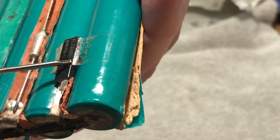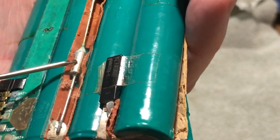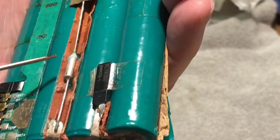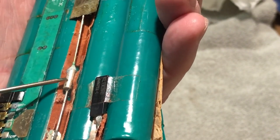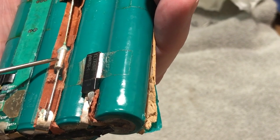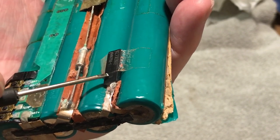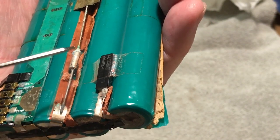When the battery is overcharged or gets too hot, that thermo cutoff is going to trip until it cools down. The diode basically keeps the cells from draining each other — if one cell is really low, it won't drain the other cells down. This protects the circuit; they put different diodes in for different things. I've checked it — it's fine, there's some writing on it. When I take this thing apart I might just go ahead and pop a new one in anyway. I'm not sure if it'll trip when it gets hot, so if I can find another one I'll put a new one in.